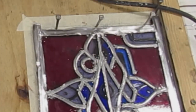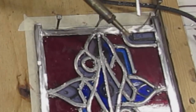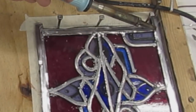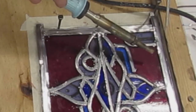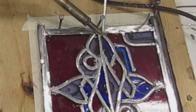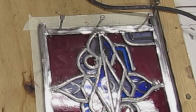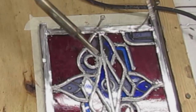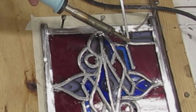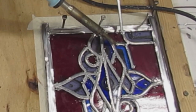Now there's a hole, and the way I approach holes is I let it go cold, so I'll normally do some other joint. Less is more with solder, you don't want too much. Then I go back to the one with the hole and I put a bit more on. So I'm going to do this one, which hasn't got any tallow on it, because this is more of a challenge, because it's going to drop through. I'm going to come back to that and add more when it's gone cold.